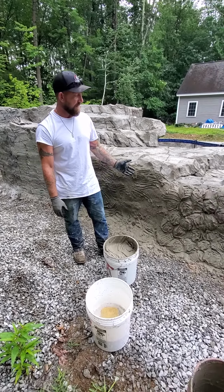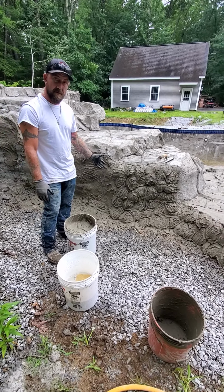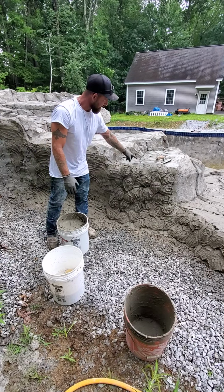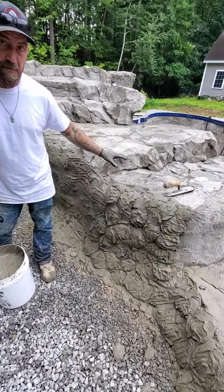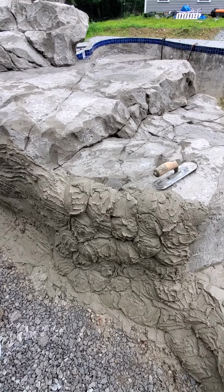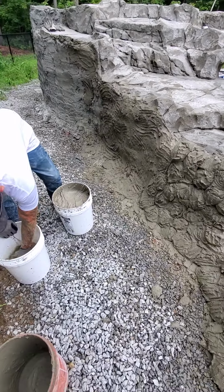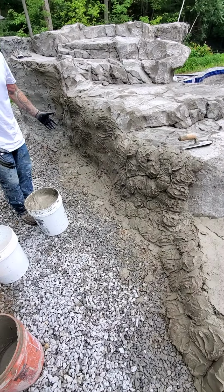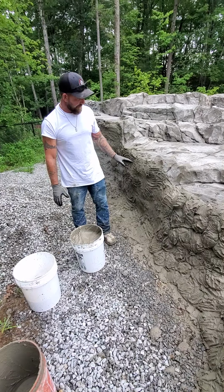I'm going to show you guys today how we do some hand bombing vertically and how to butter the seam on pre-existing cured product. Okay, so first off, I'm gonna hand bomb the vertical. And again, simple techniques, but consistency of mud, all those things play a factor.